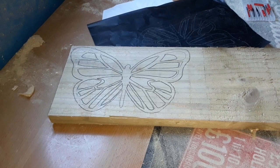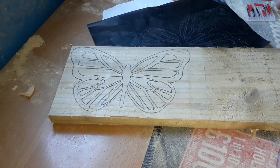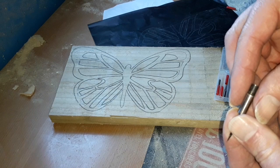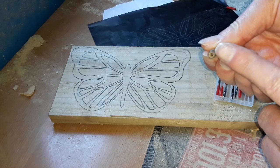The bits I'm going to use as always are these little things. I love these little CNC bits — if you go on Amazon or eBay they come in a little package like that. There are different angles, 30 degrees, 60 and so on. I've mixed all mine up so there you go. To make it fit your router you require what they call a collet, and that's just a little sleeve like so that slots over your smaller shaft of your CNC bit, and that's now a quarter of an inch and that will fit nicely into your router.